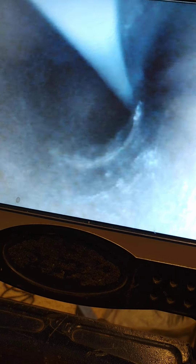I've flushed a hundred thousand times. Looking at the camera — there are no roots or anything. It actually ties onto the side of the pipe. The white you see is bubbles — I had put some soap down the sink and we flushed a lot of water through. That's our cable still in there. Maybe the city can check and see if they have a side tap instead of a tap from the top, because that might hold some water level in there all the time.